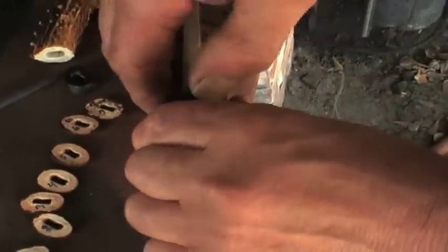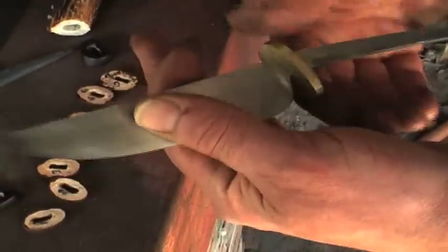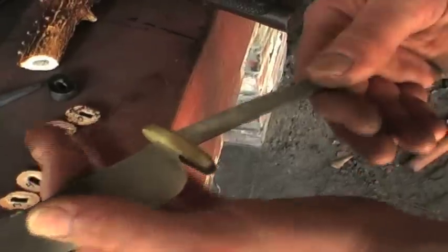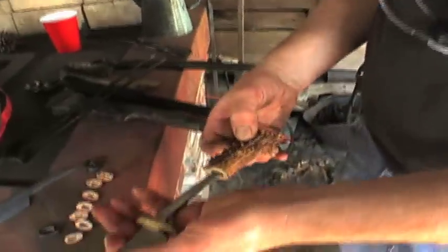And then the last one is this piece here that will also still be fit a little more as we put this together and finish. But I'm just showing that this is a non-finished blade. And this is how you would fit the guard and all in the handle. I use a 5-minute epoxy. Some people use 30-minute epoxy when they put this handle on. And they would drill and put a pin on here to hold this on.